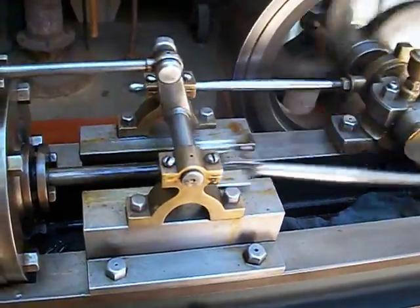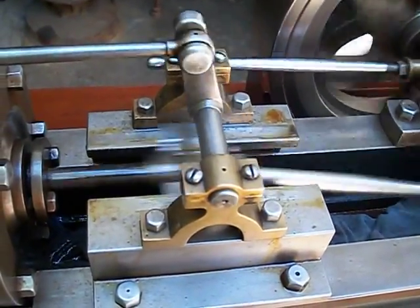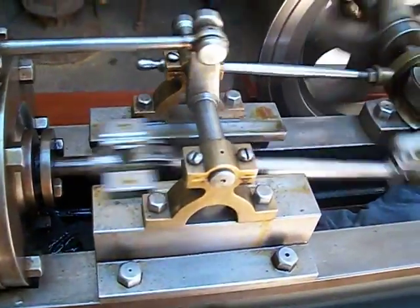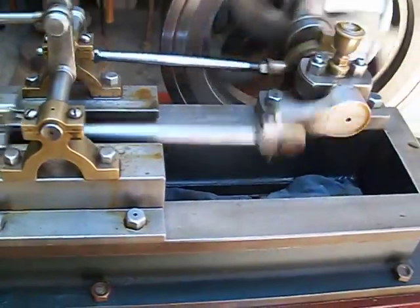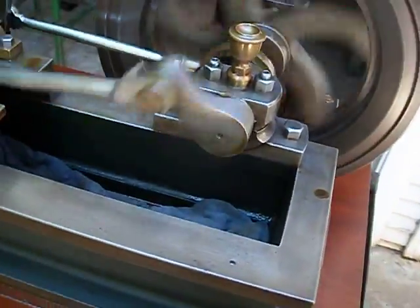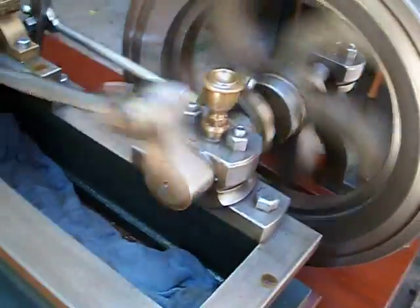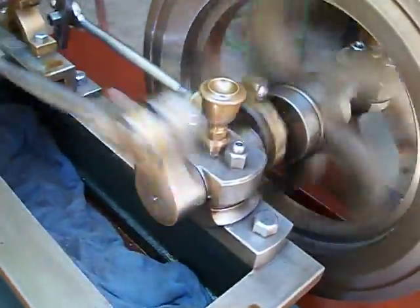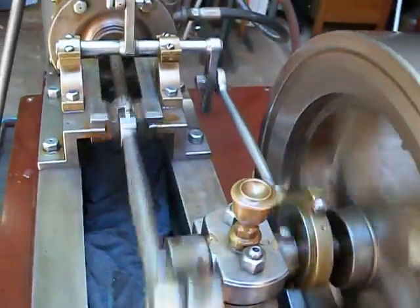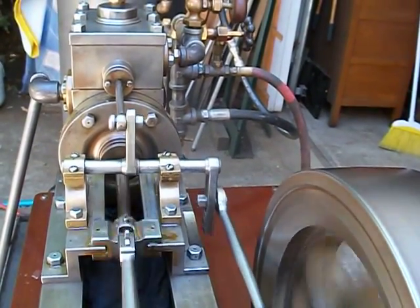As you can see, there are no bronze crosshead shoes on the crosshead. It's a very heavy, well-made engine — all the parts seem to be handmade. The bolts are all individually turned with centers and thread cut on the lathe. This engine came from the east coast several years ago.